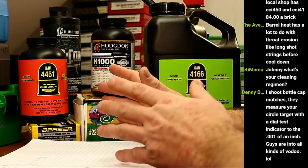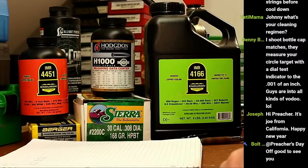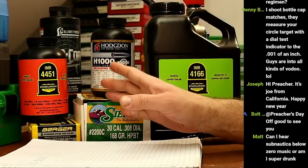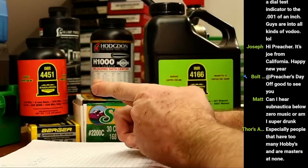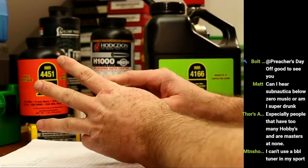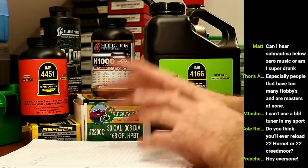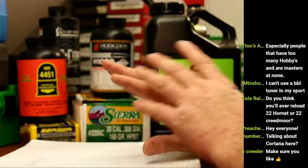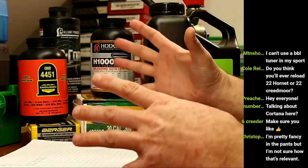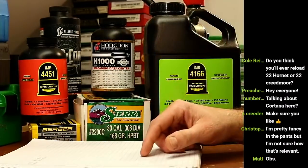So would it be worthwhile to, like, do people keep a backup gun? Do people carry a backup gun to the matches? Okay, so here's a new combination. I'm going to put a fresh barrel on my backup gun, and I'm going to shoot 500 rounds. It's going to be the entire range of powder charge, overall length, and every neck tension that's ever worked for me in the past. It's a 3 variable test sort of deal, 500 rounds to cover one shot at every single scenario you could imagine, to almost blueprint that barrel and let you see the nodes and where they're at.